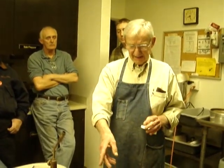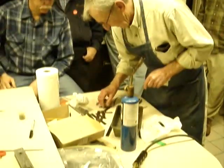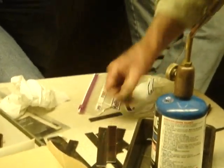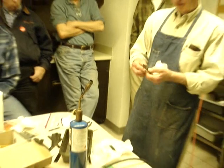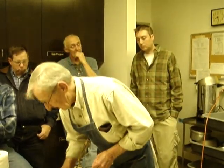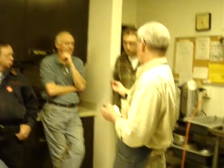Before you try to sharpen it, you want a blade like that in a hardened state, and then you want to shape it. Normally what I'll do is take these blades and put a shape on the blade before you... A lot of times I will, yes. What I'll do is I'll heat treat a 3-inch piece and see how much good blade I've got, because sometimes it'll warp on you, which doesn't mean that it's not a usable blade. See, like this has a little bit of warp. You can pass it around and look at it. It just means you'll end up with a shorter blade, that's all, to try and get some of that out of there.